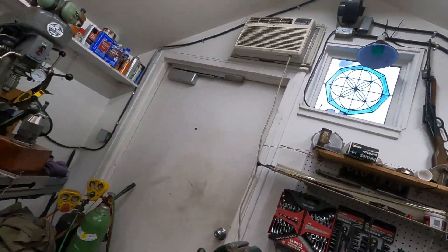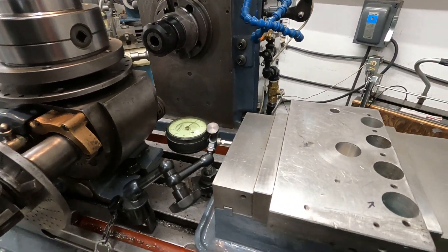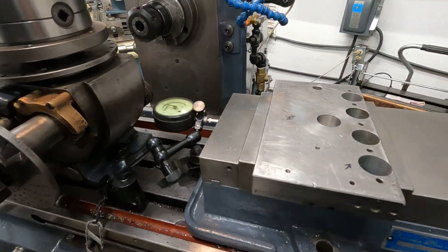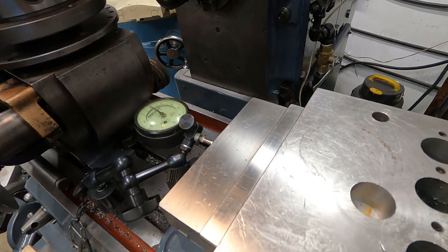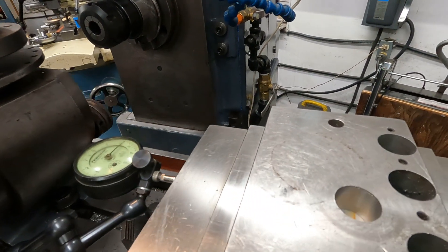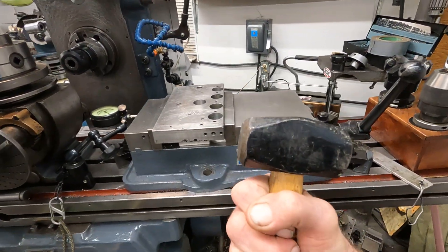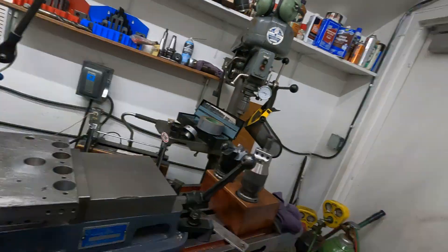To be successful working with metal, you'd better know its nature. The indicator sprung back to zero — the vise didn't stay bent. If I wanted to bend it, I'd apply the torque again like that and then give it a real wallop with a hammer under that stress — and it would stay bent to a degree. If I kept stretching it to two and a half thousandths and kept smacking it, it would stay at two and a half thousandths.